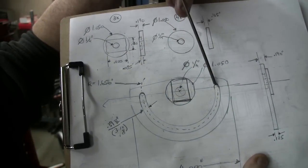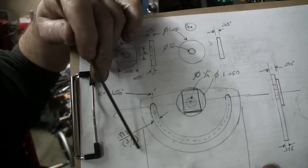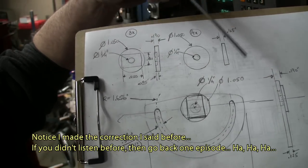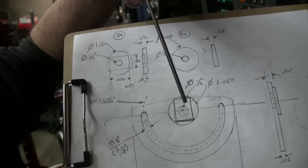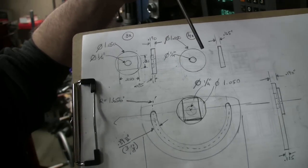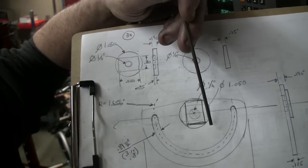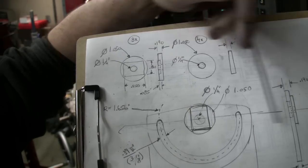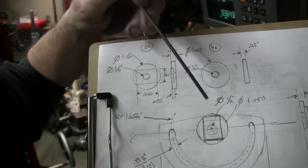We're still on with the stopping device, that's going to stabilize the tilting. So it's going to be a 3/8 of an inch groove in a semicircular pattern, and there's going to be some bolt or something on the pivot mount that's going to tighten this up and keep it from tilting or moving while we're operating the camera. I corrected this thing so it's vertical because the other part, the one that holds the boom, will go perpendicular to this.